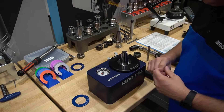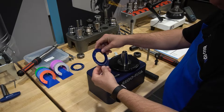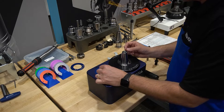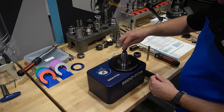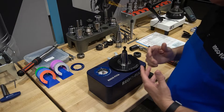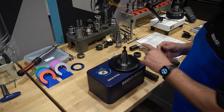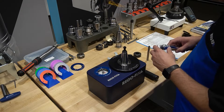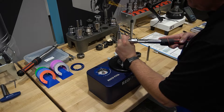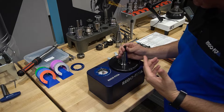We are going to start off with the assembly of our pull stud. Let's grab our Torco block ring — ER32 — and on the back side I have the settings for the pull studs. I'll set the reference to 40, take our pull stud, and hand tighten it. Then we'll go ahead and torque that down. Normally I would suggest putting on some blue Loctite to make sure we secure that into place properly. And that's all it takes to tighten the pull stud — it is now on there and ready to be used.